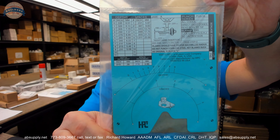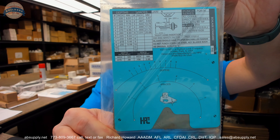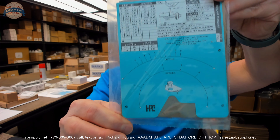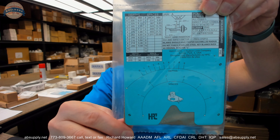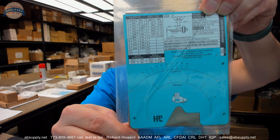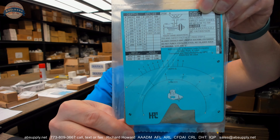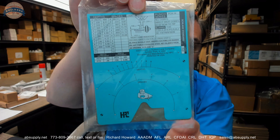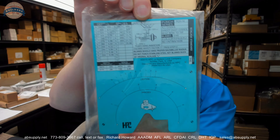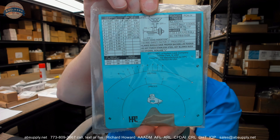That root depth would be measured from the bottom of the key blank to the bottom of the cut. You'll notice that a 6 Schlage is a longer pin than a 4. A Schlage 6 is a shorter depth measurement, and that's because it's a deeper cut — we're measuring from the bottom of the key blank to the root of the cut. You'll also get the jaw you're supposed to use to cut this on your machine.